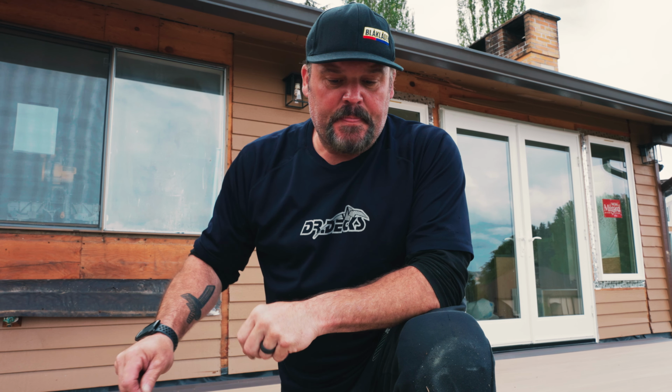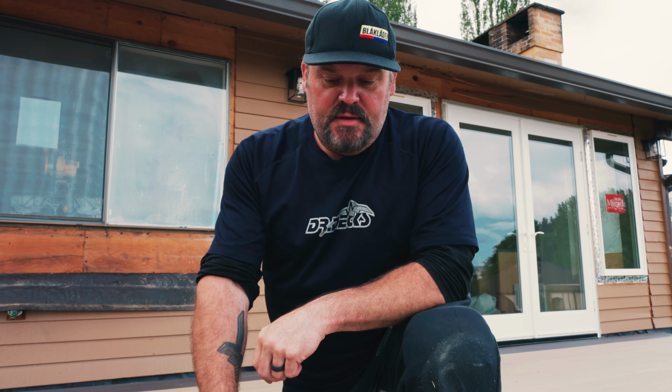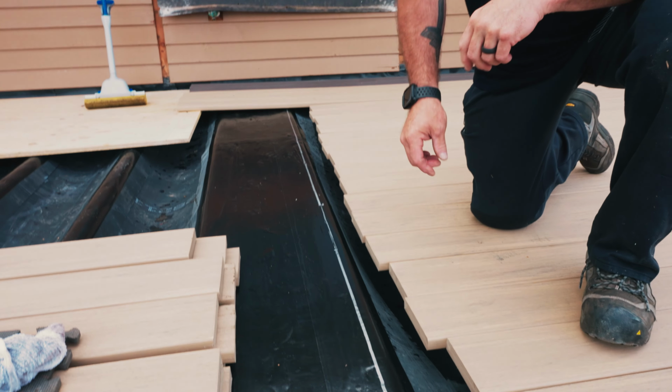What I've done is since we have a waterproof bladder and we can't see very well what we're attaching to, especially on these flat blocks where we're having a double border, I identified the center of my screw pattern with a silver Sharpie. That way I can see between the deck boards. We're gonna snap a chalk line to screw off all our boards, but I can see it. And that way I won't end up misaligning with where my screws need to go.